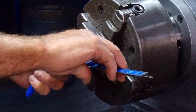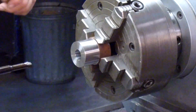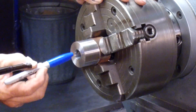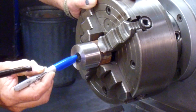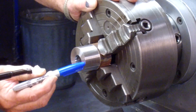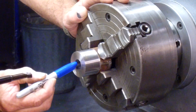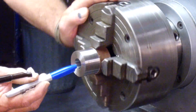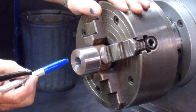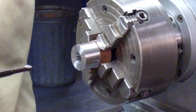Okay, our second cut out here, and we're about 746, 745. You can see right at the beginning you still see a cut solder right there, but down in here's the split line running here. We're pretty equal there and on that side there as well for how much material is left in there. It's about a quarter inch little width of non-touching yet. So we have about 100 thousandths to come out of here still.